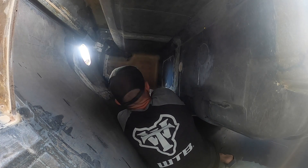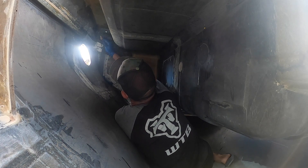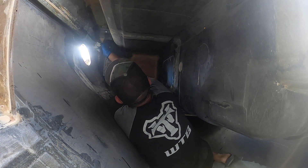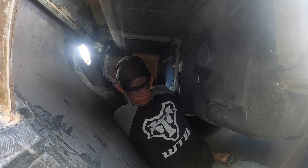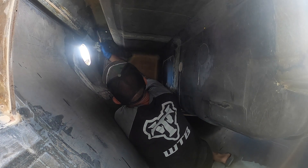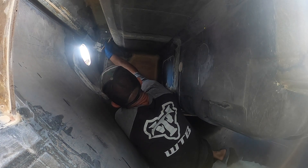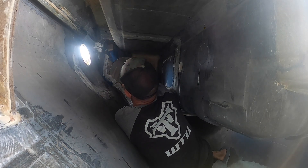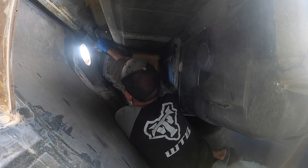See all the white? That's the new fiberglass tape, stuck in place. I pre-wetted the walls and let it sit a minute so the tape, once I cut it and put it up there just by hand, it's stuck in place. Now I'm getting this all wet. I'm working up where you can't see, reinforcing where the boat lifting eye is going to go. Do that on both sides.